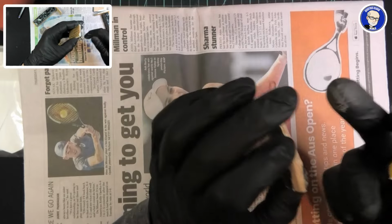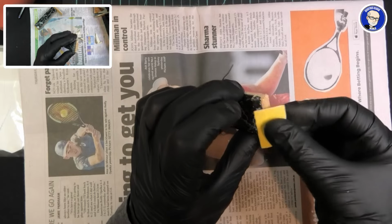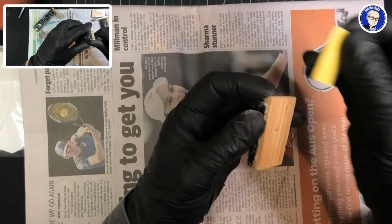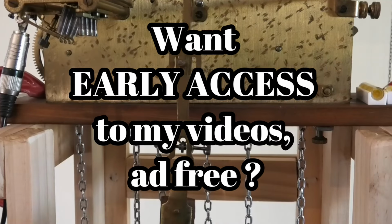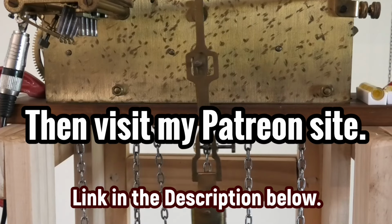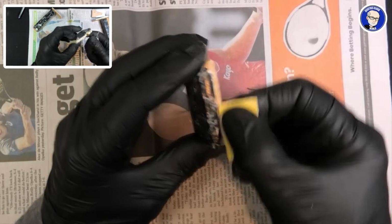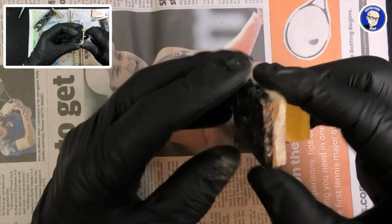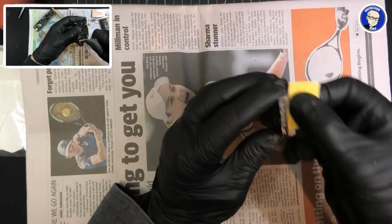And you'll notice I'm using my middle finger here as a stop so we don't roll up across here. I'm limiting the travel with my finger so I can then roll it backwards and forwards like so. It's a little bit of a catch on that corner. I'll take that off. Alright, we'll roll around this side here. The timber's pretty clean, but we're going to make sure that we've got the best surface, and that one there's pretty rough. You'll see a difference on this one. We're going to have the best surface for the glue to stick on.